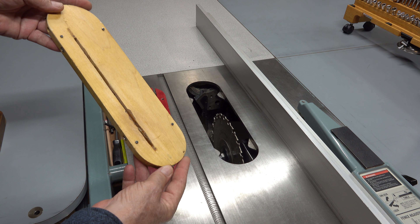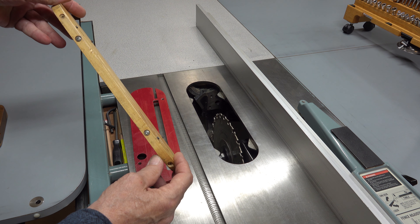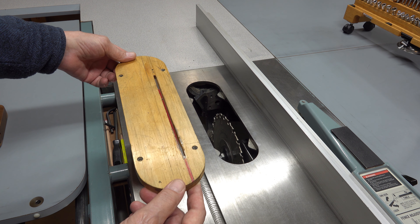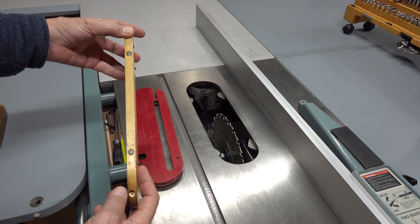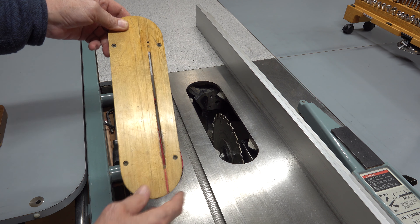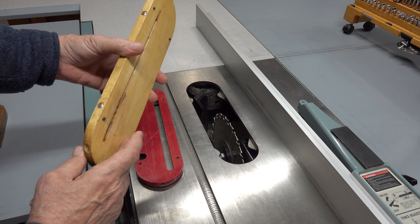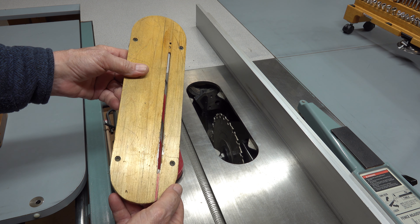All you have to really do is make sure you leave a little room for your thickness for these screws to be protruding just a hair. Your plate might change size over the years and you want to be able to have each screw take up that slop and not have the wood bottoming out. So once you have those four top ones done, make sure that they're a little bit countersunk too, so that as you raise these up and move them around, you're not going to trip over them with wood and plastic and stuff.